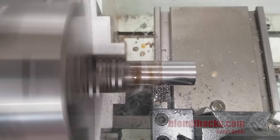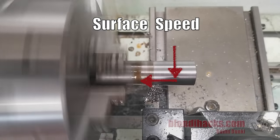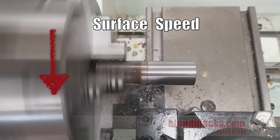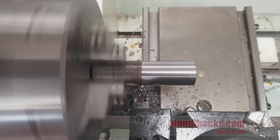The fundamental property that we're after here is surface speed. In the Imperial Machine Shop, we measure that in surface feet per minute, but that's a really stupid unit. The units don't matter — we're ultimately after a spindle RPM, so it doesn't matter what we used to get there. It could be centimeters per dekasecond or King George's thumbs per fortnight. Doesn't matter.